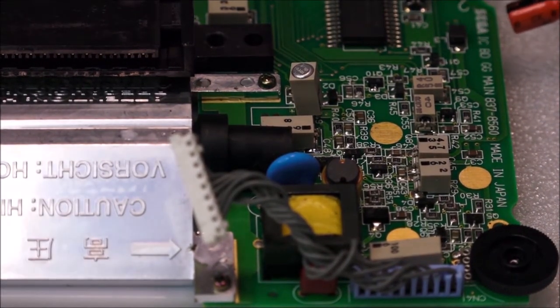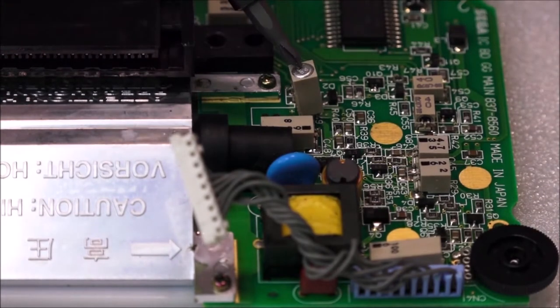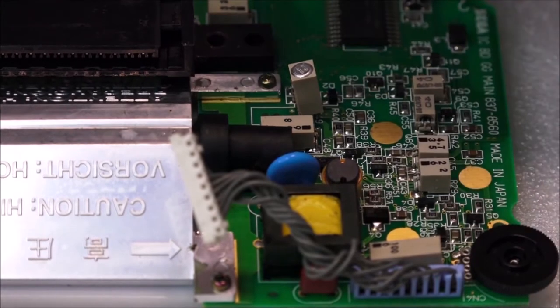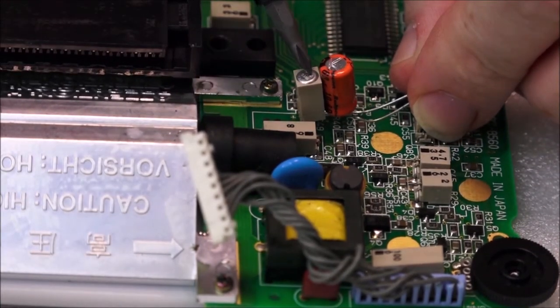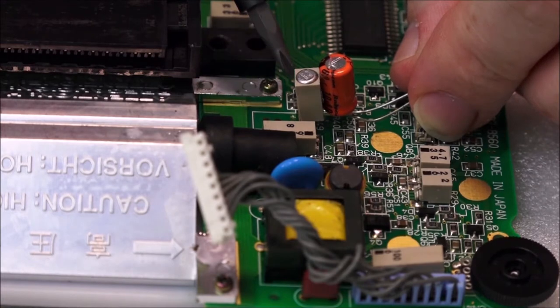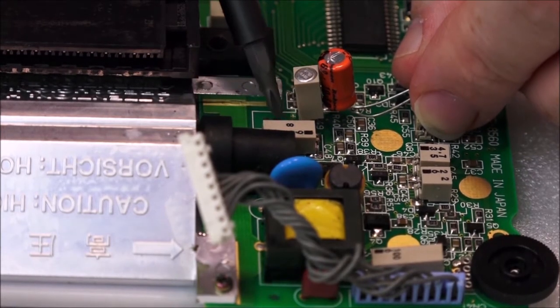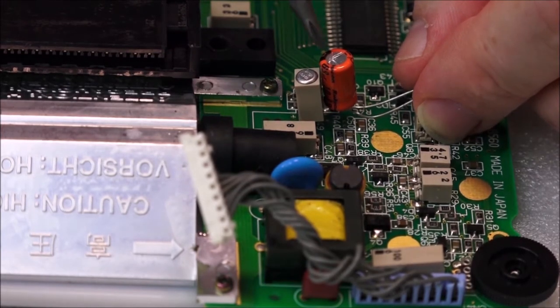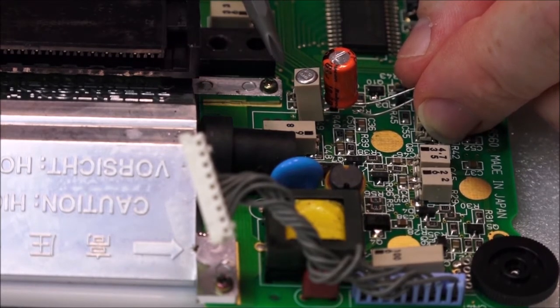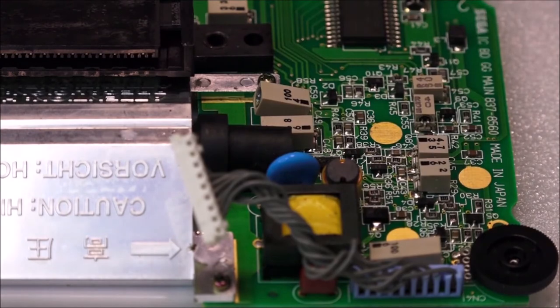Maybe we can get the light in a bit more. Okay, where are we? Right, this capacitor here, that is tiny. That is like twice the size. Let's see if I can bend the legs just so I can... Damn it, okay. Maybe the size difference. This is the capacitor, the shiny bit. This brown square is actually like a case. Okay, it's all wibbly wobbly, and that helps to disperse any heat, and it helps to secure it to the board. And this capacitor here is about twice the size of the internal here, which is the capacitor, and it has no case. So this is why there's issues when you're doing this, you have to sometimes get a bit creative with how to lay the board down. So yeah, big problem there. That's okay, we'll just finish up the cleaning here.